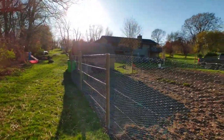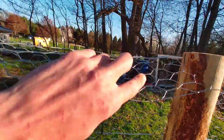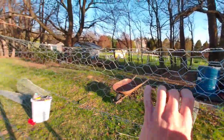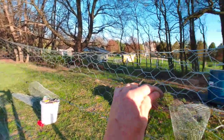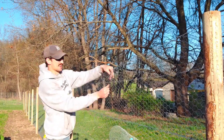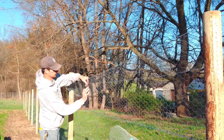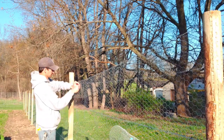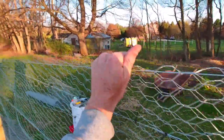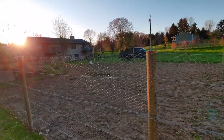Same as before, cutting about one inch down, and that's going to leave us about three feet of fence left over to work with. Now we're moving on to the last step where we're going to take this and fold it over and tie wrap it to this wire. That's going to give us a nice transition going downwards. We'll start by pulling it up and over, then take a tie wrap and put one here — we're going to do this all the way down the same way. When you're going along with the tie wraps, it also helps to fold this over and pinch it down so it's tight with the wire. Got a real nice smooth transition going downhill.